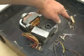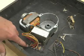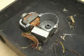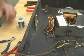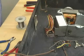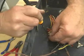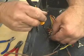Remember we've forgotten about the switch. We're not interested in that. The mains goes to the outer 2 of these tags. So I've got a piece of wire. Let's get soldering. So we first need to remove the old wires. There's no polarity of course here because it's AC, and we can put the iron, which I say is not really up to this job.